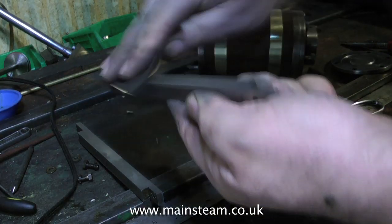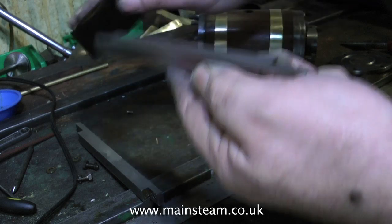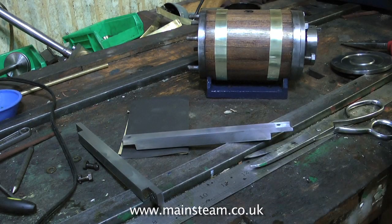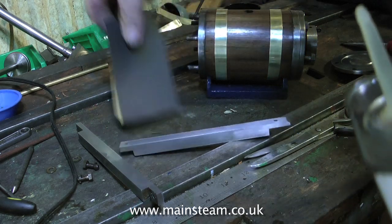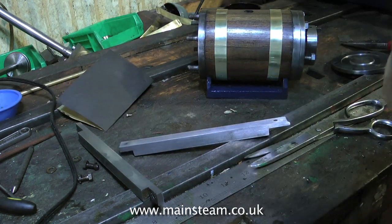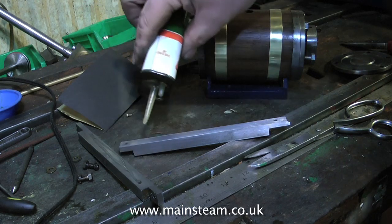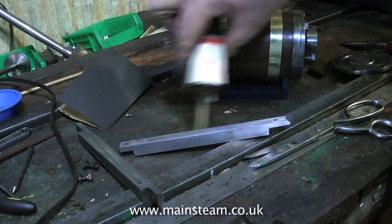Away from the painting, it's time to look at cleaning up the metal parts. I would normally use wet or dry sandpaper for this. I don't always like to polish things, and wet or dry sandpaper used carefully gives a good finish without rounding the edges. Once you've cleaned the metal with wet or dry sandpaper, don't forget to oil it.